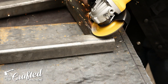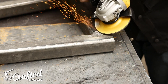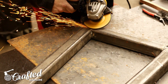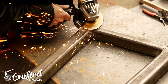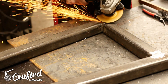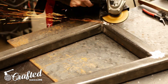After finishing up my welds, I ground them down flush with the surface of the tubing using a grinding wheel on my angle grinder. You might notice that I'm not wearing gloves in a few of my grinding shots. I've heard a lot of conflicting advice about gloves and spinning tools like the angle grinder. Some argue that gloves can get caught in the tool, which also gets your fingers caught up in it. Others argue you should always wear gloves when using an angle grinder, as it can protect you in case the tool kicks back. The choice is yours — in this case I felt it was maybe safer not to wear gloves.